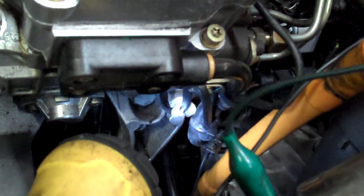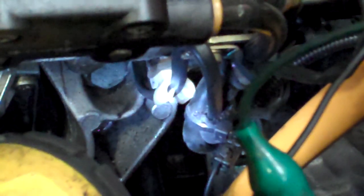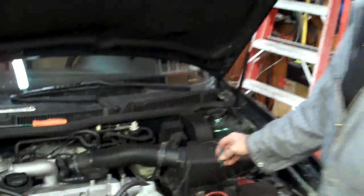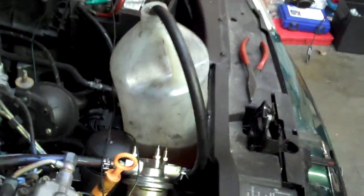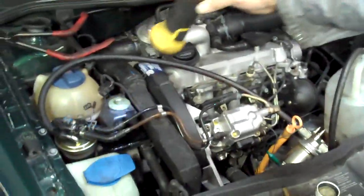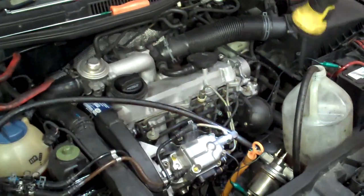I'm going to energize a little pump here, so we're going to force some fuel in, just to illustrate the leak. I can see underneath the pump — I just saw a drip down there. You can see the drip there. So now we're going to bleed the fuel system. We have a jug of our B99 here and an electric lift pump. It's going through the filter, and it's going to force some fuel back to the tank because all this is filled full of ultra-low. So I'm going to crank it, bleed the system, and then start it.